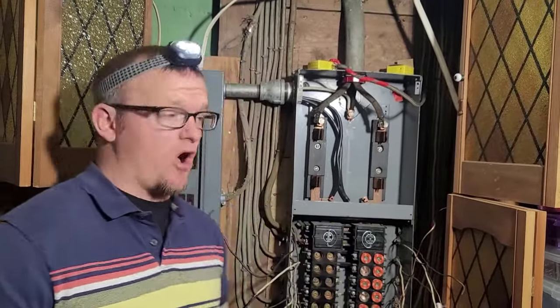Let's go ahead and look at this panel. There's a provision in the code now that requires overcurrent devices, but this is a really cool old panel. When you pull this out — and we know this is off, our whole home is off, always verify with at least two forms — these are really cool breakers. There are metal feet in the back, and the clasps are right here on the top and they're open. You set it, it slides in, and the knives actually grab right into the panel. It's one of the original ones that still had a fuse as the overcurrent device — a hybrid fuse circuit breaker box, one of the very first ones.